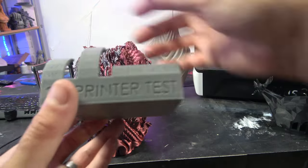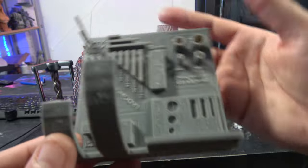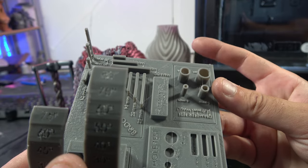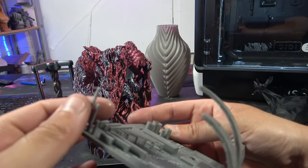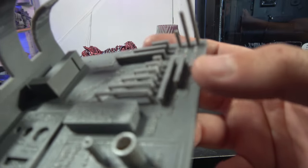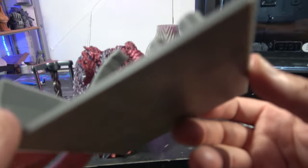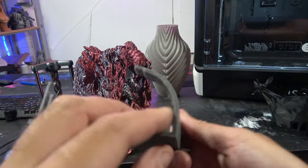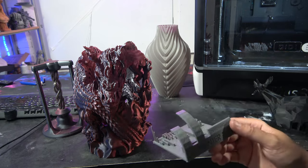Back to the print tests — this is the 3D printer all-in-one test. You can read all of the text, which is pretty rare. This was done at a 0.16mm layer height. There's a little bit of wispiness around some of the retraction tests and some of the bridging tests. But bridging and overhangs have done really well — everything on here is good up to about 65 degrees on the partial curve and up to about 60 on the steep curve. Overhang performance is really quite good.